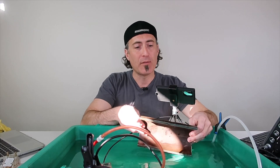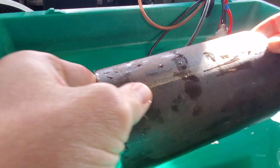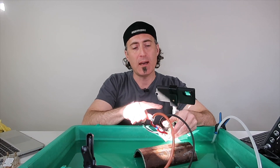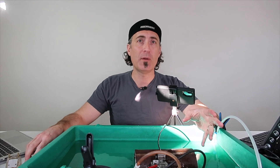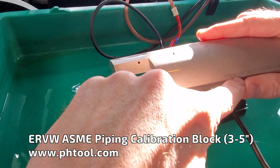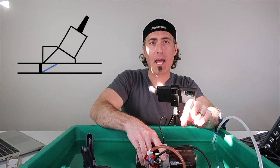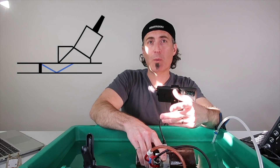We're going to compare a regular wedge and a PAF wedge. I've got a four and a half inch OD pipe sample with some through wall holes drilled in it — some closely spaced ones and a couple spaced a little further apart. I have a regular A31 four and a half inch AOD wedge, a five megahertz 32 element probe, and a mini wheel encoder so we can measure things. I'm running 45 to 70 degrees with a half degree increment, and I did a quick two-point TCG using the three to five inch ERVW block on the 10 millimeter step using the half-T side drilled hole. I've set my focusing depth at one and a half T. At the 55 degree angle we'll first hit the bottom corner trap of the through holes, swipe past all of them, save the file, and then do it again and hit the top corner trap at the OD. Then we'll switch wedges and see what happens.